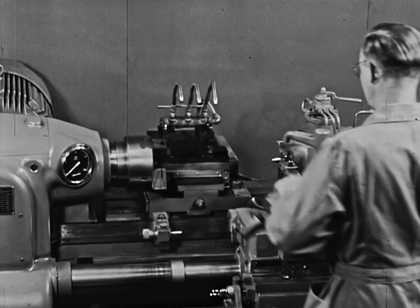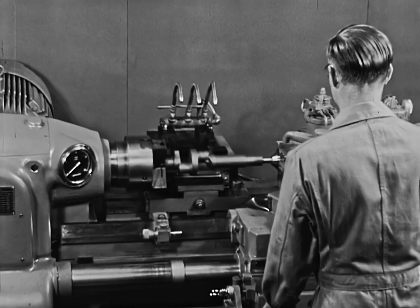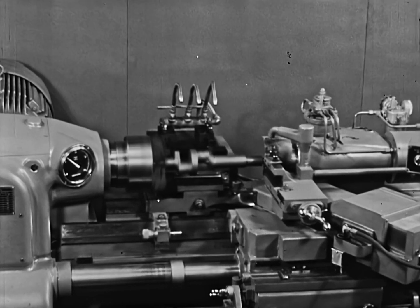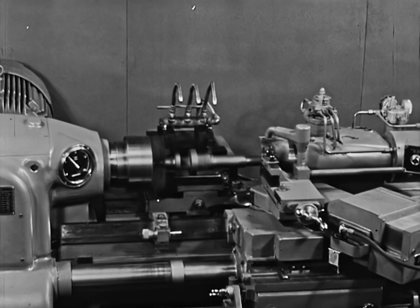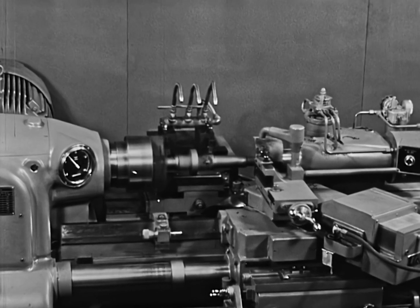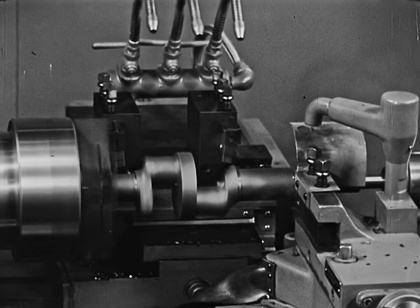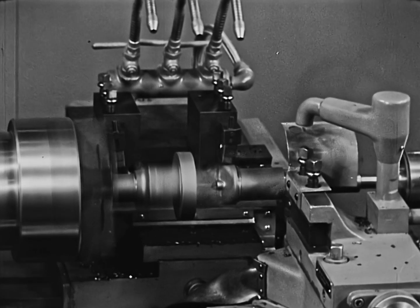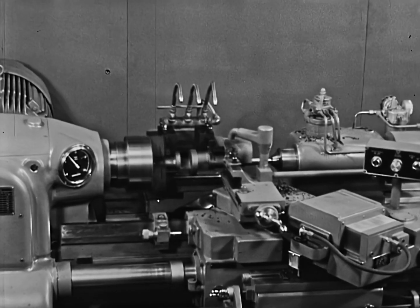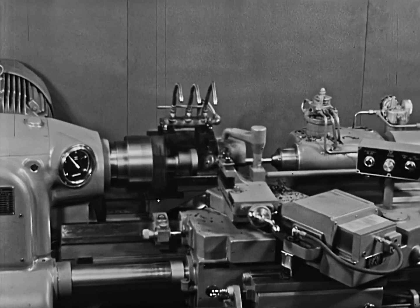And now for some actual cutting operations. Because of many sizes and designs, crankshafts have been expensive problems for compressor manufacturers, particularly those in the air conditioning business. But now many producers are finding our Model 20H cuts the cost of machining sometimes as much as 50%. For this crankshaft job, two monomatics replaced four turret lathes. The material is ductile iron. The crankshaft comes to the monomatic face to length and centered to depth, held between centers and driven by a three-jaw compensating air-operated chuck.